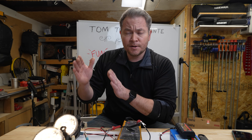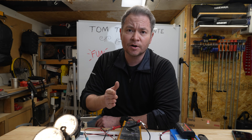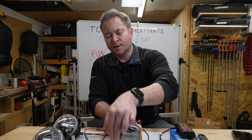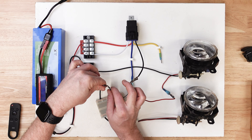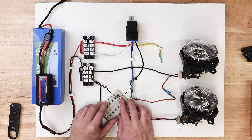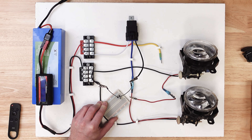This could be a 30-amp load or a 50-amp load — it doesn't matter. It will still only require 150 milliamps in order to trigger that circuit, and that is what makes relays so cool. So I'm going to disconnect my Fluke meter and put in its place a little breadboard with about 20-gauge wire and a very low-amperage momentary switch rated for about 200–300 milliamps. With this little momentary switch, I should be able to switch those lights off and on — a four-amp load, with very small circuitry.